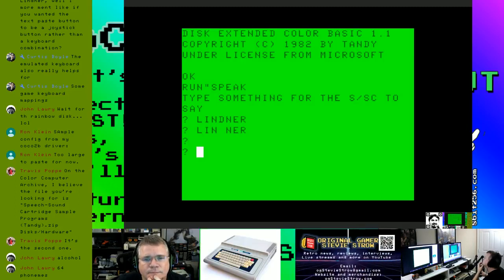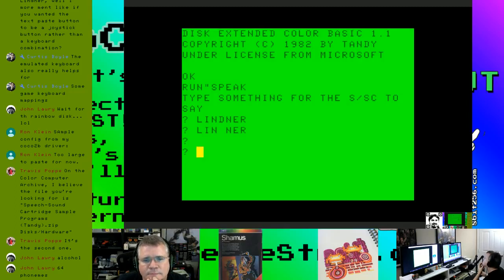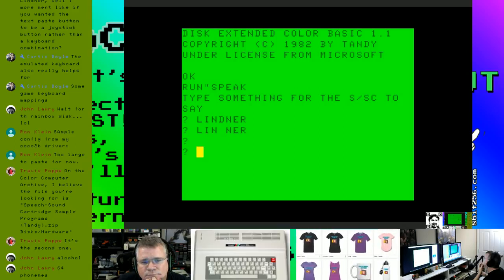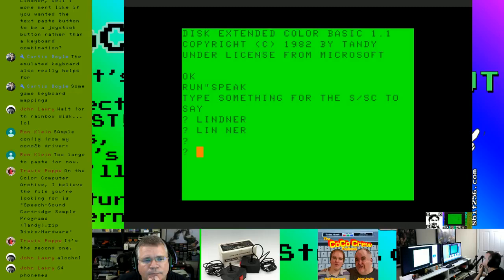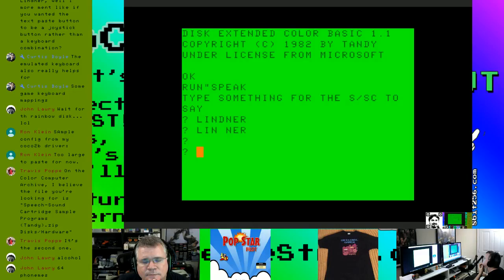You can make your mouth wide. You can tighten up your lips, and all these things change the way the sound comes out from your vocal cords. They got it down to 12 different variables, and they modeled them mathematically. If you change the coefficients of these formulas over time in the same way that your body does, you get something that sounds like speech. And so the program running inside the speech narrator is adjusting these 12 variables over time to make the noise generator that it contains sound like speech.